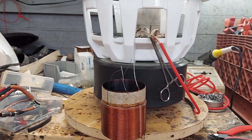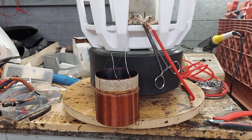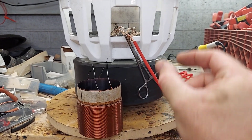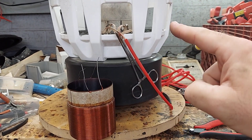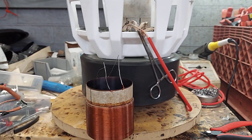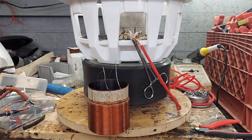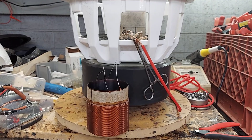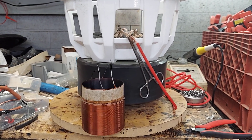Back to what you're seeing in the market - high BL. Nothing wrong with high BL except that it tends to be more peaky. It has a sharper Q, which means that at the resonant frequency it's sharper, much higher - more resonant-y. The resonant peak is greater. Nothing wrong with that. It's just more definitive about playing low, meaning at your FS, that's it - you're not going to get anything below that.